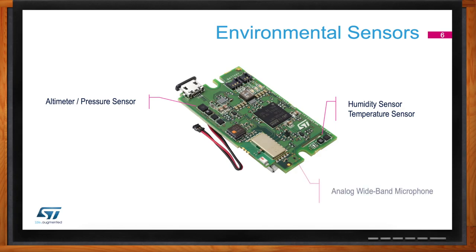Finally, but not the least, we have an analog wideband MEMS microphone which can actually reach 80 kilohertz of frequency — very high frequency. Common applications for the environmental and audio sensors can be weather stations, temperature control for industrial, thermostats, acoustic sensing, voice pickup, and eventually even detecting a baby crying using our microcontroller and STM32's AI ecosystem — which is a function pack available on ST.com. The baby crying detection example is available out of the box with the Sensor Tile Box app and the STBLE Sensor app, allowing the user to have an AI experience based on audio detection.